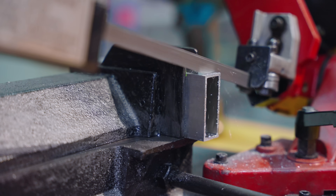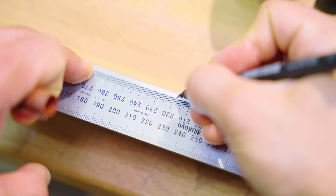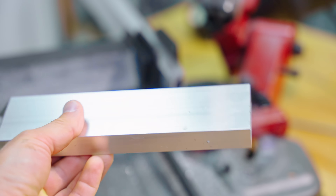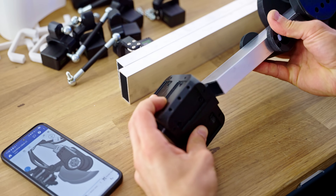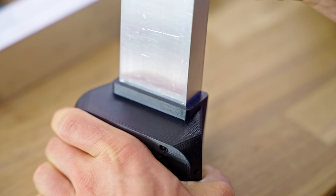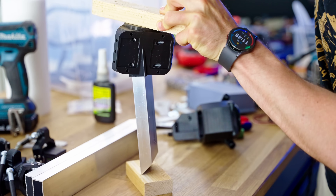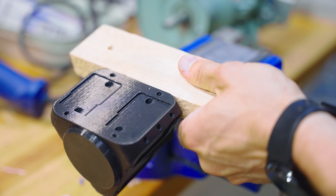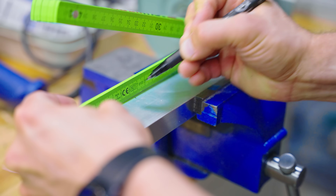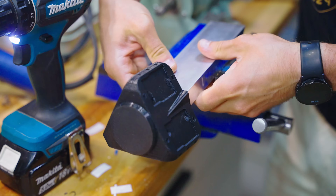We'll come back to those servos later, but in order to finally attach them, I have to build the rest of the robot first. While most of the functionality of Carolin uses 3D printed parts quite extensively, there are still some components you shouldn't make out of plastic — and that is the actual structural members of the arms themselves. For these I'm using plain aluminum square or rectangular tubing. The entirety of the aluminum tubing cost me about 20 bucks. Not only is it really cheap, but for our purposes it's pretty much perfectly flat and straight, and because it's hollow tubing where all the material is on the outside shell — like in a 3D print — it is, pound for pound, some of the most rigid material you can use for this application.